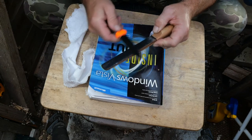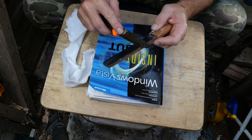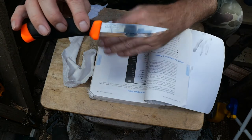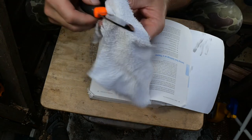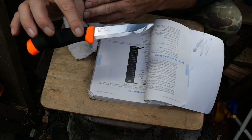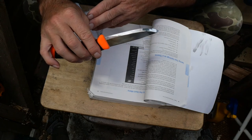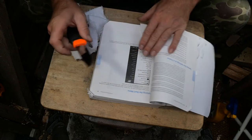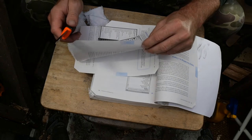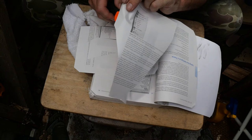See, I've got flat on the bevel now — the strop is nice again. So I can go about this. This is the side that had the issue, but it's okay now — I think we're there. You can see it's in a nice state of polish. Take the paste off — this paste leaves a bit of a film which is anti-rust corrosion, so it's good stuff. You can see the bevel is flat, it's Scandi, everything's been done Scandi apart from what you just saw on the strop. Let's have a look at the sharpness in paper and then do our tests on some wood.